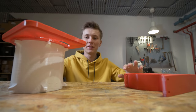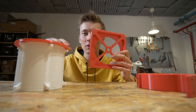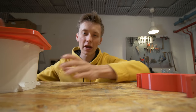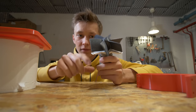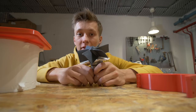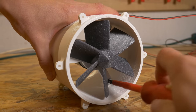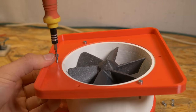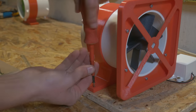Here are the parts for the duct fan experiment. This will go here like so, and I want to try if this kind of duct fan can be used as an air cleaning solution for my workshop. For that I will use the 775 motor with the old propeller just to test if it works — this motor is a little bit more quiet and should be powerful enough for this use case. Unfortunately I wasn't able to find any appropriate piece of felt to act as a filter, so this part of the project is not yet finished. I still have to test it, and this will probably take a month or two, so I will update you in a future video.